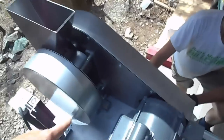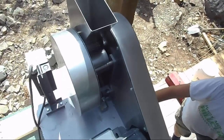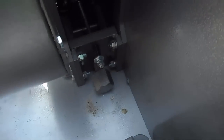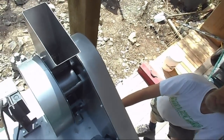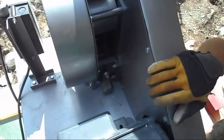What would it take to set that to crush smaller? Oh yeah, all we have to do is adjust down here, and we can crush it down to — I think they say an eighth of an inch on this one. I have it set right now for probably about three quarters of an inch. If we could reduce that to about five-eighths or half — you saw that the rock was a half an inch thick, banged down fine, but it came down on an edge and stopped. All it takes is adjusting this to any size we want, and I brought a big wrench to do that.